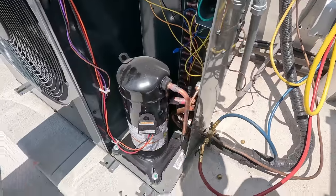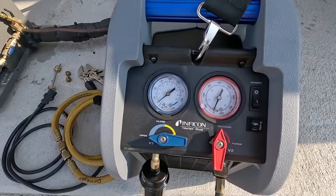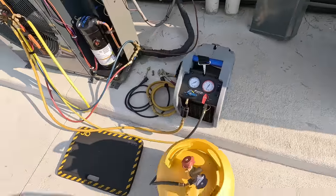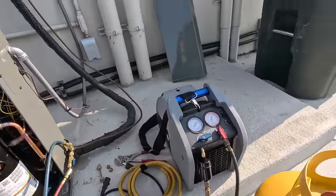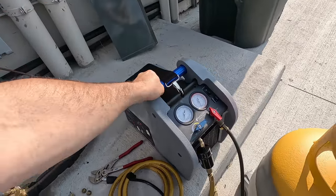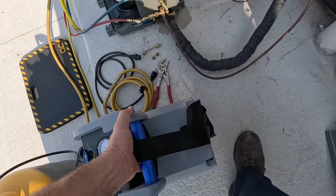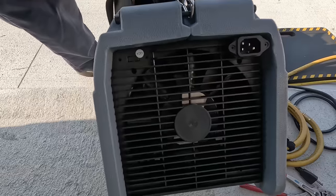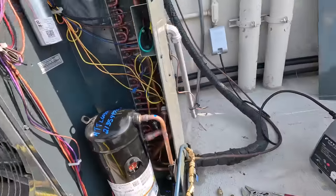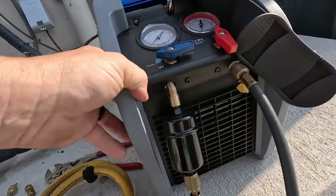Like that, we're right back to changing the compressor. We've got the new Inficon Vortex Dual. My good friend over at Inficon sent me this to try out - you guys have been great with the leak detector, let's try some of your other stuff. It's got a strap so you can carry it up the ladder, not very heavy. The fan on this thing is huge - I think it's a one horsepower motor. We've got 410A and a completely empty jug. This thing is supposed to recover 410A faster because of the microchannel they've got in it and the bigger motor.